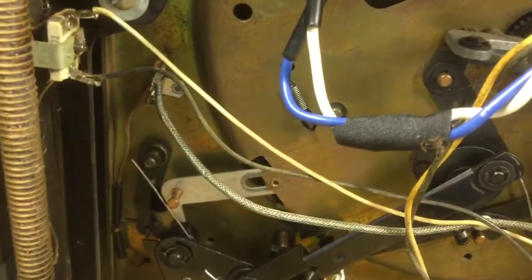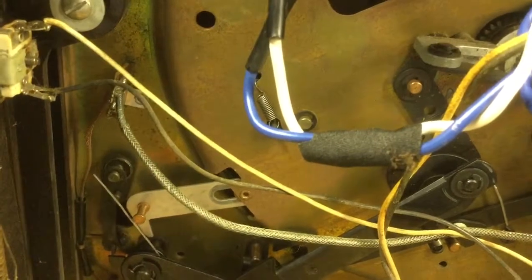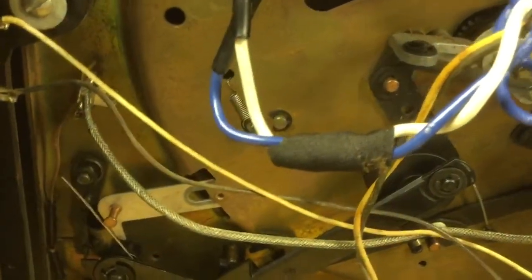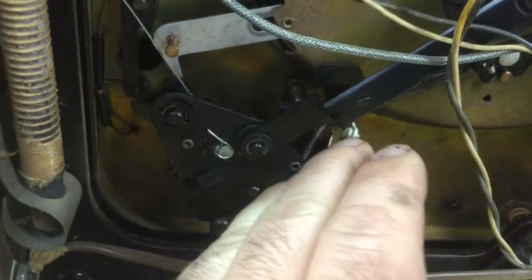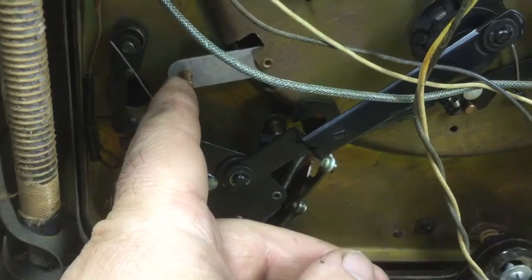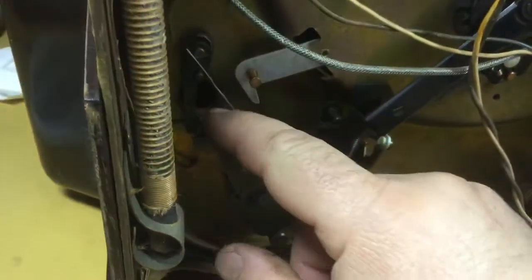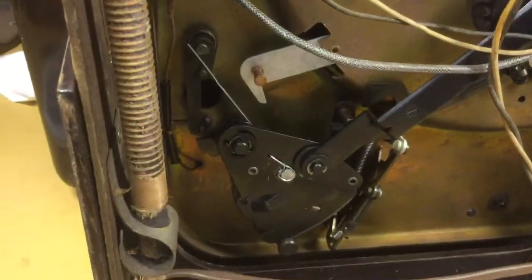And when the tone arm moves in at a faster rate of speed than normal travel, it causes a pawl to kick over and engage the cycling gear so that it cycles. And then as it cycles, this wrist plate here turns back this way, and this spring pushes the trip slide back and resets it. And I noticed it wasn't resetting. So adjusting the spring, trying to get a little bit more action, and it broke right off.